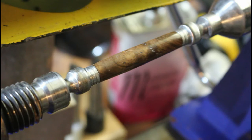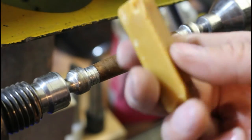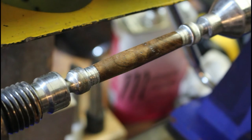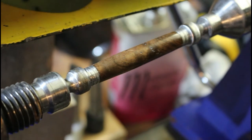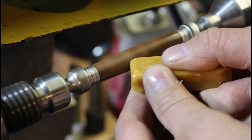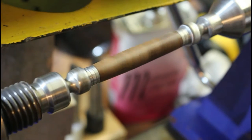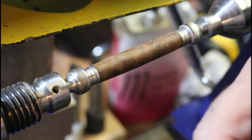That's come up lovely. Now the last one we're going to use is carnauba wax. Use the solid one and make sure it's a good quality one. I'm going to turn the lathe on, keep it at a thousand again, and we're just going to make one pass, nice and even, across the surface of that blank. Get a clean piece of kitchen towel - you do go through a bit of kitchen towel on these, that's the only downside to this finishing method.